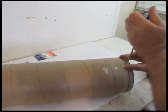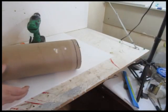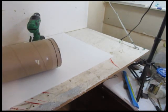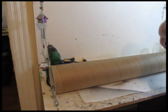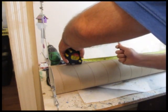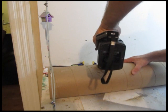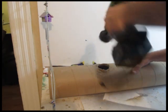After this, a couple more things and then we collimate the telescope. Collimating is aligning everything so it works properly. See — nice and flush with the back, and we can adjust those screws to set the mirror. Now we're going to do the eyepiece. We're not going to mount the eyepiece quite yet — measure it out and mark it. Drill a pilot hole, and then a large hole large enough for your eyepiece. I forget the exact size — it's like two and an eighth or something like that.